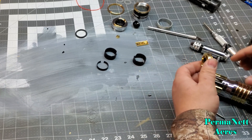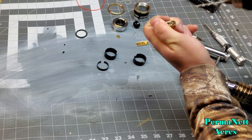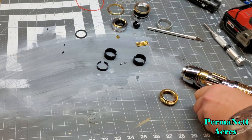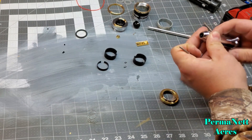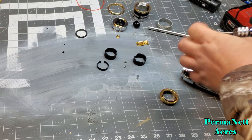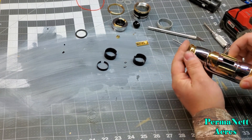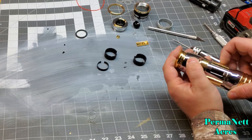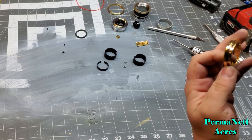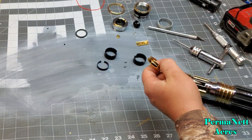Got that hole drilled out. I'm going to remount this — the hole is not a whole lot bigger than it originally was. Then I'm going to grab my tap, tighten this down, slide this in, and get it nice and snugged up. So my next step is putting this on in place, lining it up, making sure my hole lines up. I'm going to put the two other set screws in their holes so I don't mix them up.